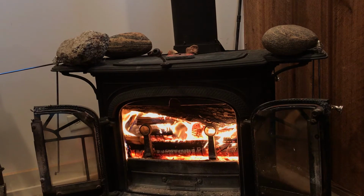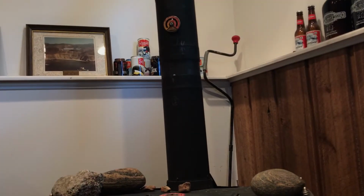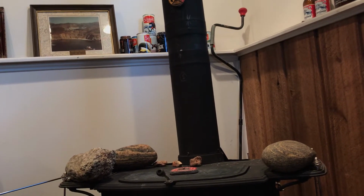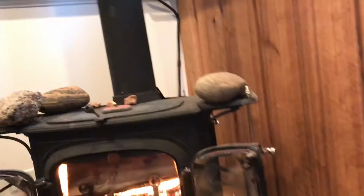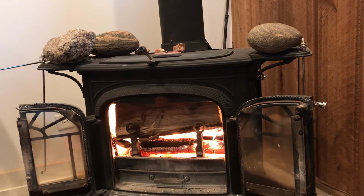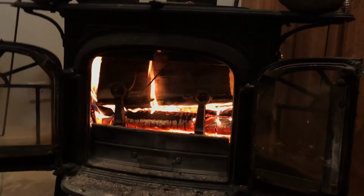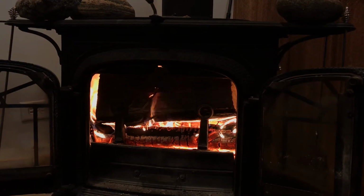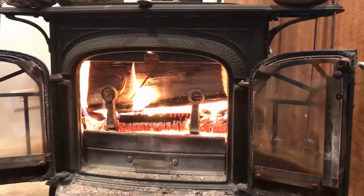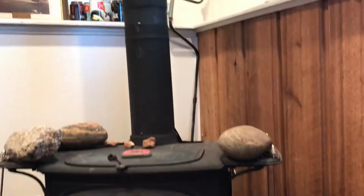Alright, so now my chimney's getting up to some pretty high temperatures. It's in the 500. So this thing's really, really hot in there. And I want to get that to sit down in those jet hot flames. Let it get ripping. And now, to cool things down, because this thing's really getting up there, which is good, this is all really hot. Before I overfire my chimney and cause damage, I will close this.